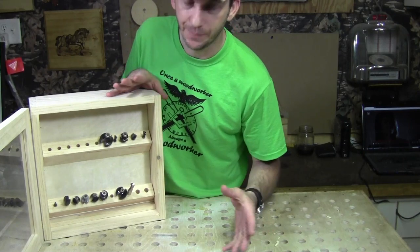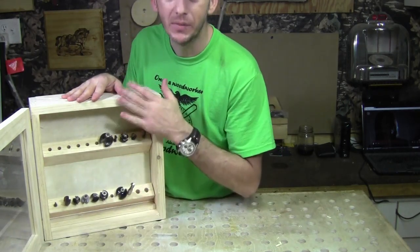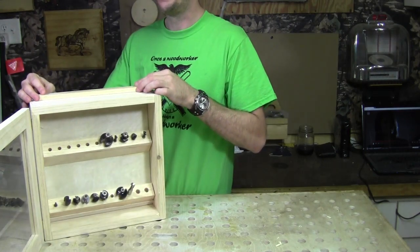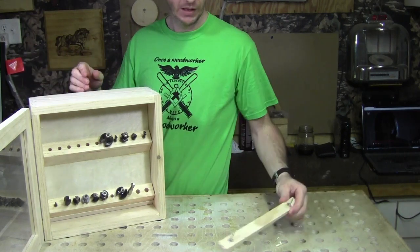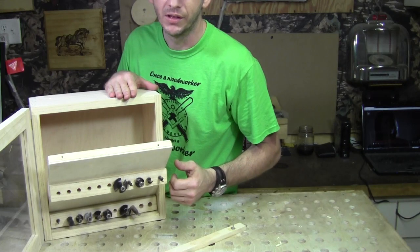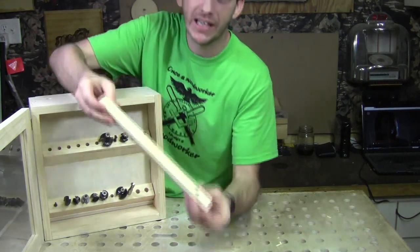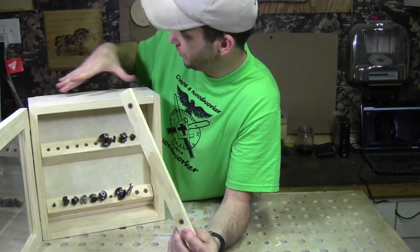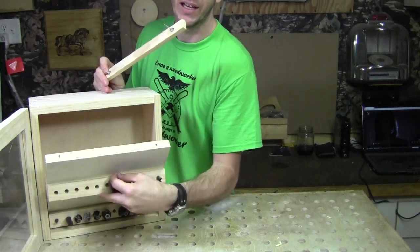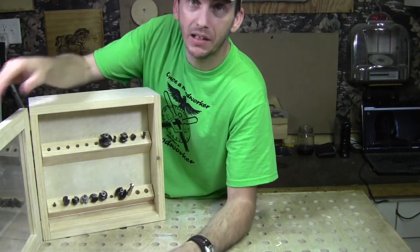I like to hide things in plain sight. Down here at the bottom of the box, I just have a board, and when it's made of the same material as the case, when it's in its place it just looks like part of the case. But when taken out and slid across the top where I have those two nails, it pulls the nails out, which allows me to open up the cabinet and have access to the secret compartment. The simplest form of key I made is just two rare earth magnets placed the same distance apart as the two nails in the top — they're just meant to catch and release so I have quick access. And the key will always just stay right there, looking like part of the case.